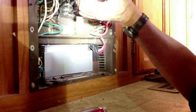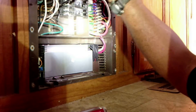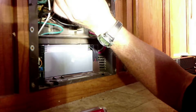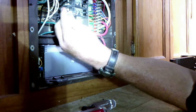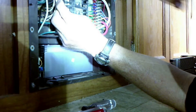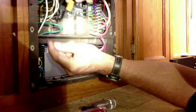While we're in here with the tool in hand, we're going to check to make sure everything else is snug in this panel box. This stuff can work loose on you - not likely, but it can. We didn't find anything loose. They even provide a wire nut to put that piggyback wire back on - that saves a lot of tape. As always when we do a wire nut, we tug on both wires to make sure everything's secure - and it is.